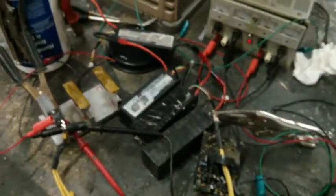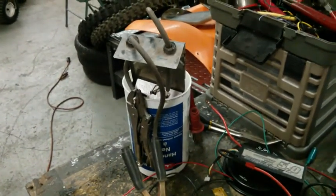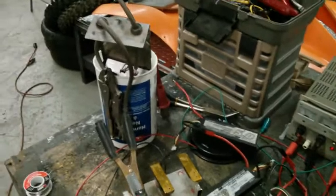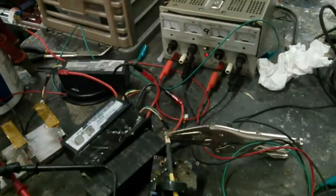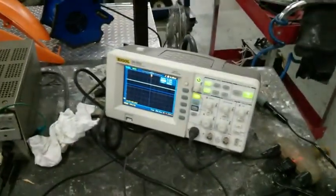Basically, I'm cheating, just running a dead short through a LiPo battery load tester designed for 12 volts. It usually does about 50 amps at 12 volts. Well, with 4 packs of 16-point-whatever volt charged LiPo, it runs a little more amperage. 3 of them in series usually ends up being 147 amps, and that's what the last test did. I used an old blown up power stage with a working current sensor on it, also fed by my Lambda power supply to give the output, and then I'm reading the output on the oscilloscope. Seems to be pretty accurate to measure.